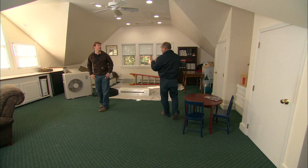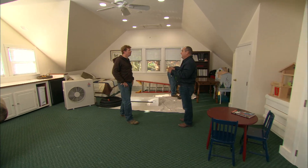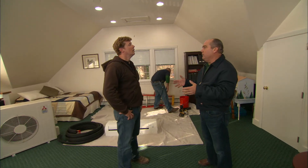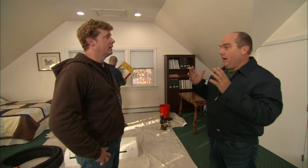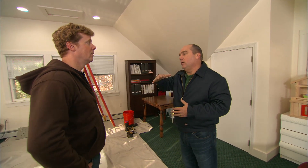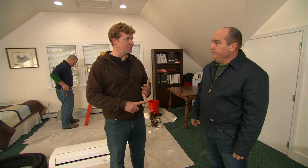There is no air conditioning at all right now. Any time I think about heating and cooling a space, it starts with a thing called the heat load — how much heat is going to be lost on the coldest day to outside, and how much heat will be gained during the hottest day of the year. We know it's 700 square feet; that goes into the calculation.